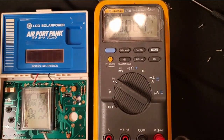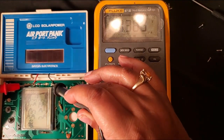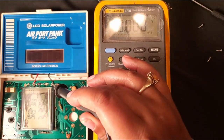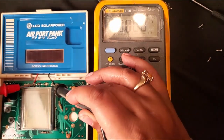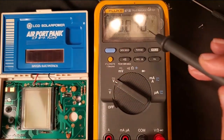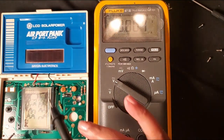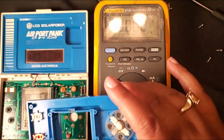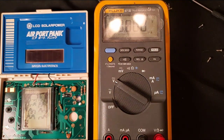This is interesting — it almost looks like there's some type of short going on. If I don't touch just the right spot it goes off, but if I remove it, it comes back on. Over here it's fine, but over here if I'm not touching in the right spot, everything goes off, the voltage starts to drop, and the display goes off. Looking at what's over there, there should be nothing wrong.